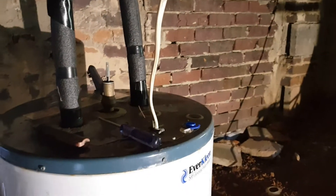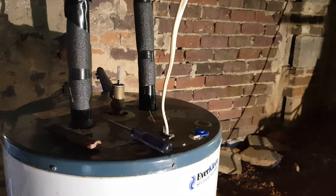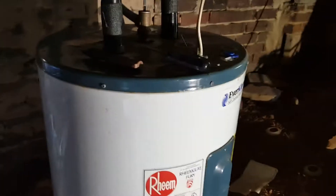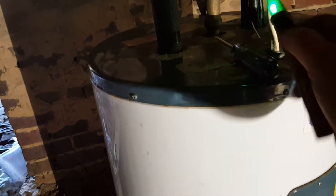Be careful when you're working with an electric or gas water heater. This line over here is a 220-volt wire connected to a double 30-amp breaker on the panel. Make sure you know which breaker turns off the power to this, and test before you grab any wire. If you don't feel comfortable, hire somebody. This tester will tell you if a wire has power just by getting close to it — you can see there's no power here, which you want to confirm because it can kill you easily.